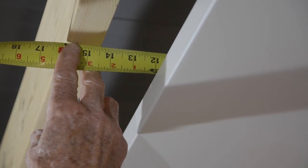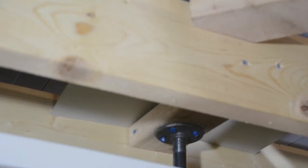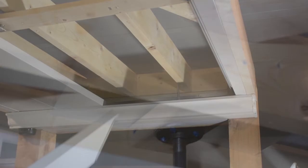16-inch on-center joist spacing leaves 14.5 inches between the joists. We supply 15-inch wide flashing that fits over the fan and swing mounts between the joists with an upward bow as an added protection against leaks. Seal the upper sides of the flashing against the joists.